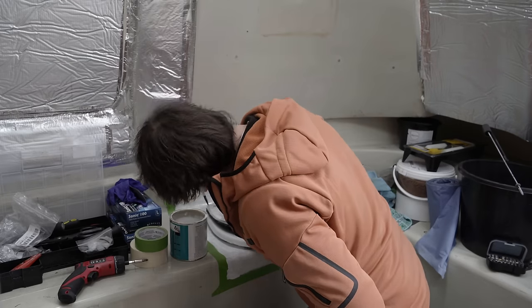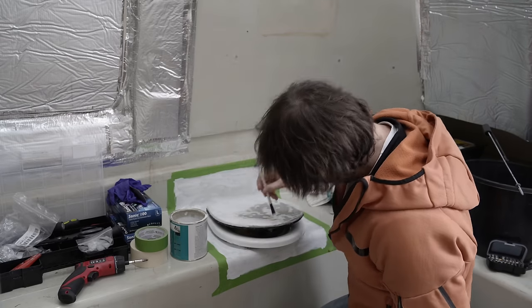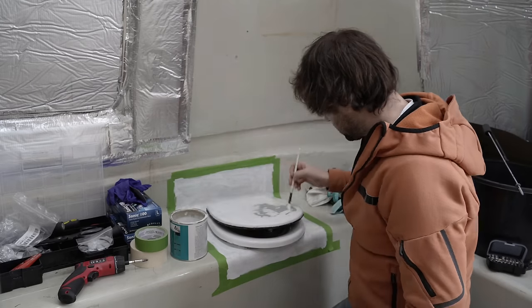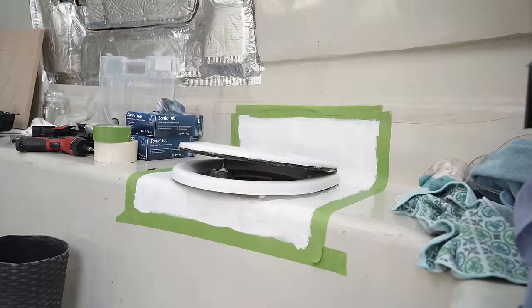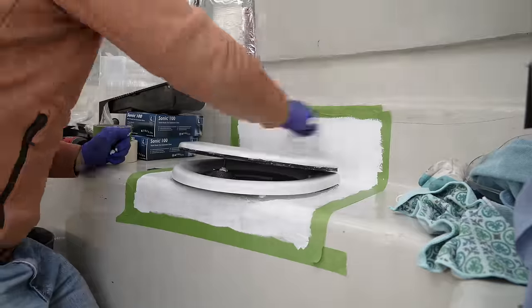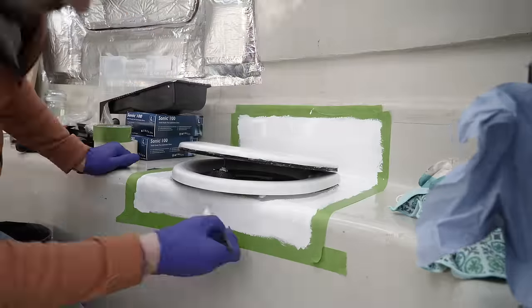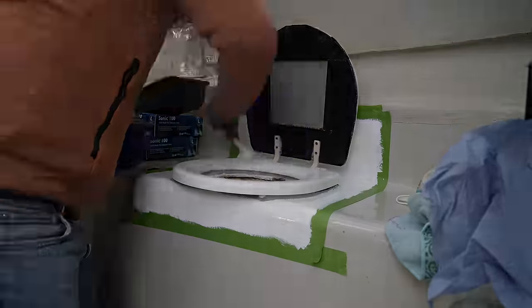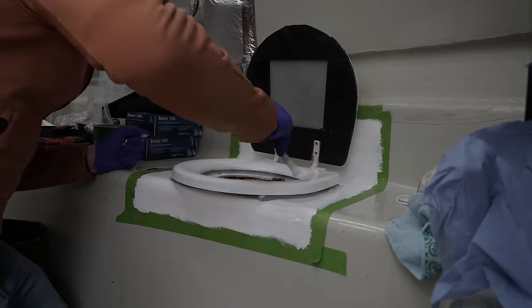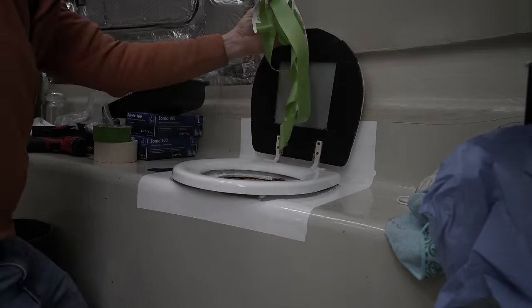I'm using a small detail brush — I started with this to go around the hinges and narrower sections, and then frankly thought it would take longer to get the brush cleaned and replaced with a larger one than to just get it done. The final finish would be later with an oil-based top coat. I'm a big fan of a particular high-opacity white top coat intended for bilges and lockers — the tough semi-gloss finish, oil resistance, and value for money make it very useful, and it adheres to the Zinsser primer really nicely.